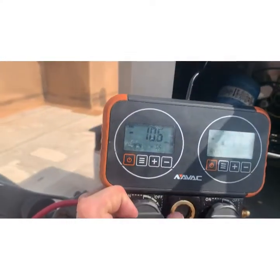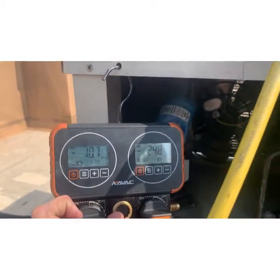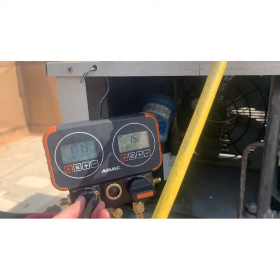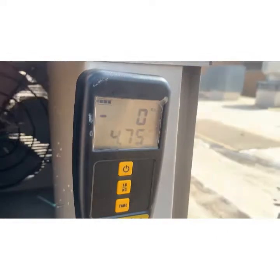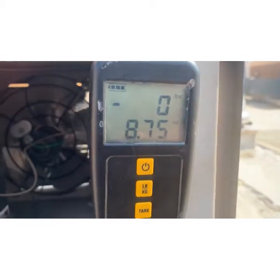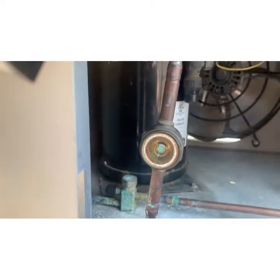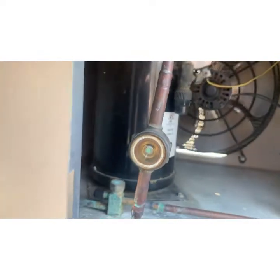And we're still in a vacuum in the system because I shut that off. So now we're not going to introduce anything. The line is purged, and we're going to open this up, and we're going to start bleeding in Freon. 7 pounds is the target, right? But again, we have a sight glass, so the reality is, other than for weighing it out for usage and cost purposes, we're just going to fill it to the sight glass.